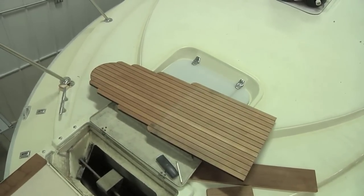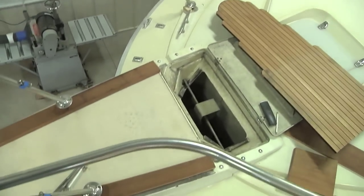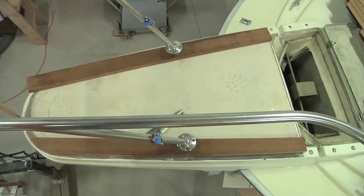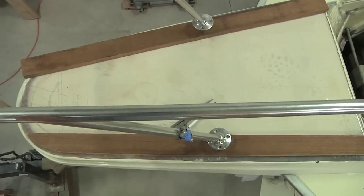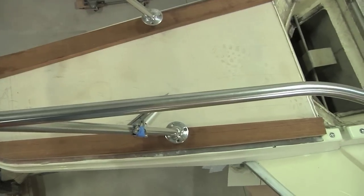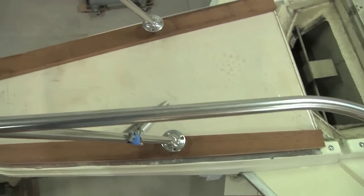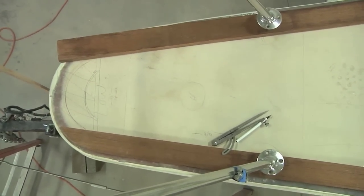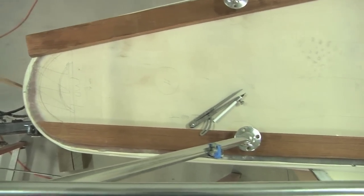Now we have both sides of the panel cut and shaped, and it's time to turn focus over to the side border trim. I've already gone through and laid these in place and roughly shaped the outside edges — they're not entirely done, still a little tweaking to be done, but roughly where they need to be, giving me my 1-inch reveal on the edges. I've gone through with the compass and traced the inside edge, which gives me my one and seven-eighths inch trim. Let's take this over to the bandsaw, get it cut out, do the final shaping, then lay the panel down to trace out for the nibs.